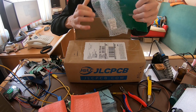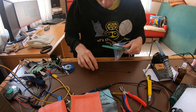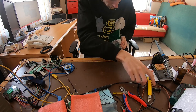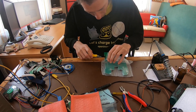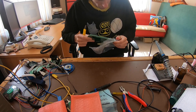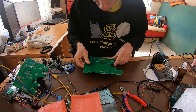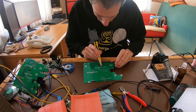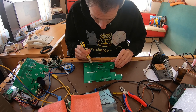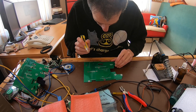I had to order a minimum quantity of five, because that's how it is. That will allow me to populate different connectors for different experiments. It's got quite a lot of connections. We've got the gate driver board connection — a flat flex ribbon thingy here. And I've pre-connected it to the signals as I rang them out. Some signals I couldn't identify, so they are just called pin 10, pin 11, and stuff like that.